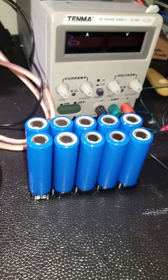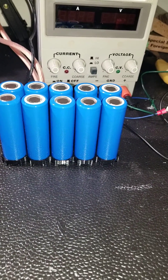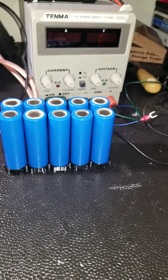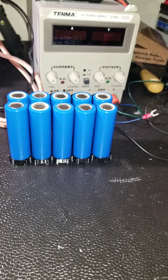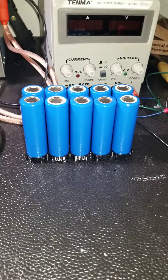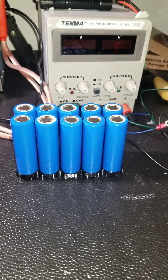The stock pack is rated at 25 amps — they claim 30, but it's not even close to 25. I put a shunt in and was logging data, and I didn't even get close to 24 amps. With the same form factor, I'm confident I can package 35 amp power with the new design.